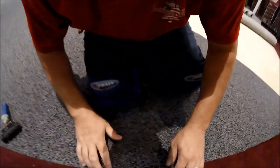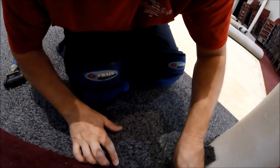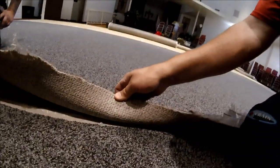If you'll notice, I'm turning and tucking it in there so I don't pinch any nap, and I am mashing the glue in between the two carpets. Because this is a Shaw non-ravel carpet, we don't have to worry about the seams fraying or pulling loose or anything like that. So we are able to overlap it and double cut it — we don't have to run rows in it. This stuff is virtually impossible to run a row in anyway just because it's such a tight knit carpet with a real tight backing to make it non-ravel. So what I've done is overlapped the carpet about two inches.